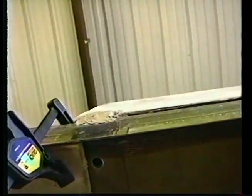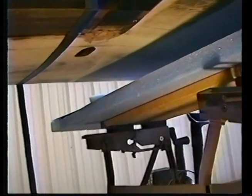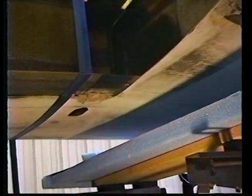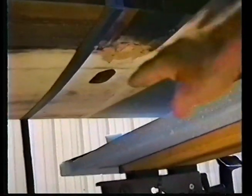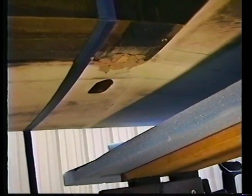There's the relationship of the upper wing surface here. As I mentioned, it's about an eighth of an inch above and about an eighth of an inch below right there. Tapering to the wing actually being just a hair above the bottom surface of the main spar. Spar is actually below the skin. But because of this angulation here and here, you can lose that with fill very, very easily.